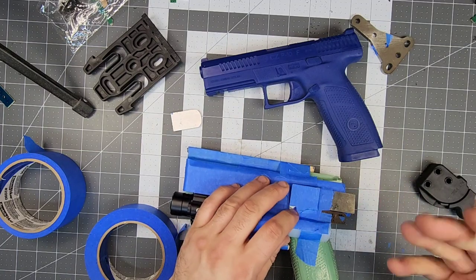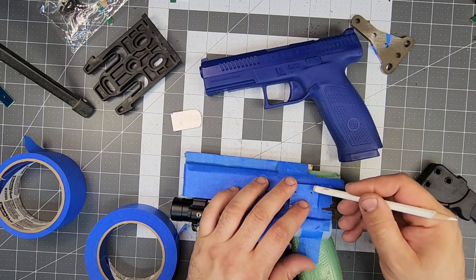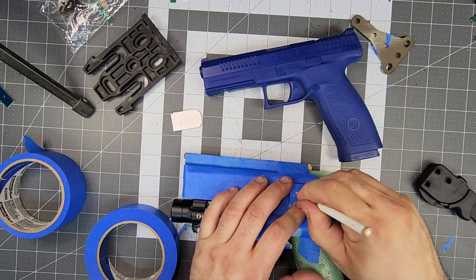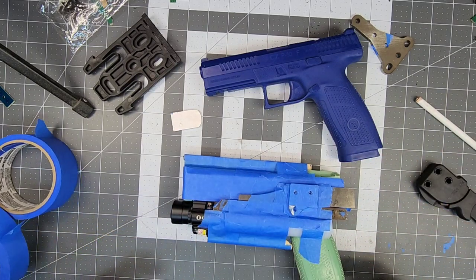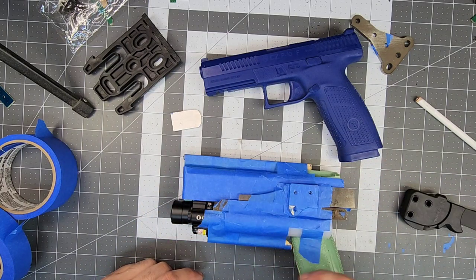And even though we're doing foam press, I like to poke the holes. Reason being, you can see the indents of the holes after you foam press, so you know where to drill. So you don't have to line this up and drill through it, which is what I used to do before I drew the holes in that blocking.